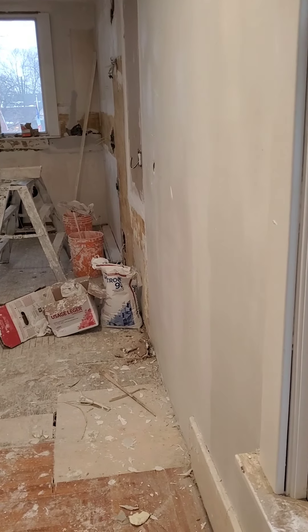Yesterday was taping, today is actually coating. Day three on the job, day two taping. All this stuff was really really bad, so it's got two coats of the Sheetrock 90 flat coat to straighten it out — and now as you can see it's a lot straighter. It's got one skim coat of the finishing mud, so that actually has three coats on it just today, all the way around, down, and across that top.